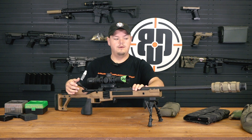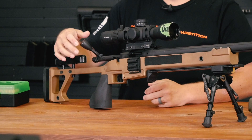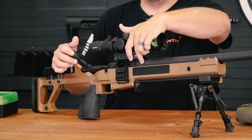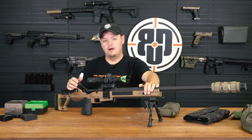Barrels are expendable - they're like tires on cars. You get a finite amount of life out of them; once they're gone you just replace them. Some features you'll see on semi-custom guns: an upgraded trigger, having the bolt knob done - the 700 bolt knob is kind of small, the Badger ones are bigger and easier to grab - and a larger recoil lug, another Badger part. You'll see an exponential increase in accuracy jumping from a production gun to a semi-custom gun, while keeping it more cost-effective.